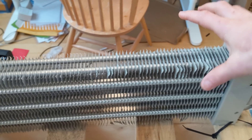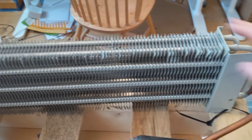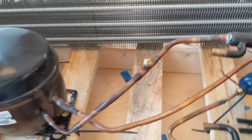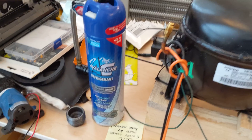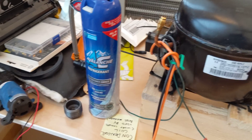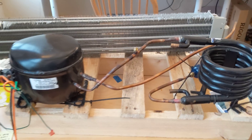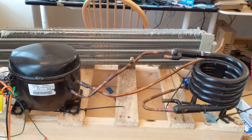The low pressure gas is cool because it flashes here, so just having that cool gas run through the evaporator gives you a little bit of cooling — but not much, really, you just get a block of ice right here. I charged it with this stuff, which you can just get at the auto parts store. It's R134A and they'll happily sell it to you. So, the world's crappiest air conditioner that actually does work, just not practically.